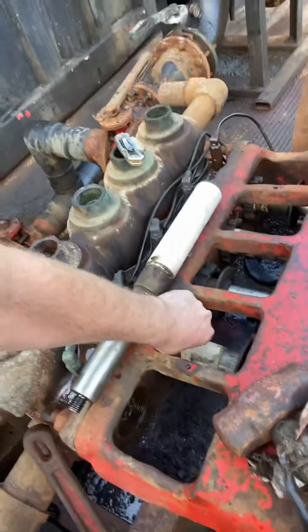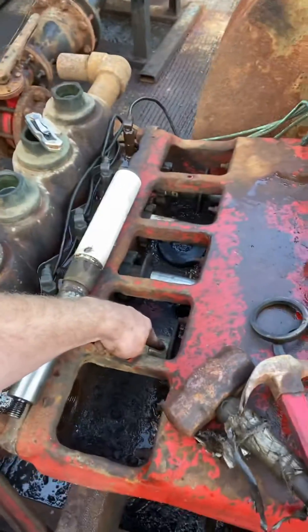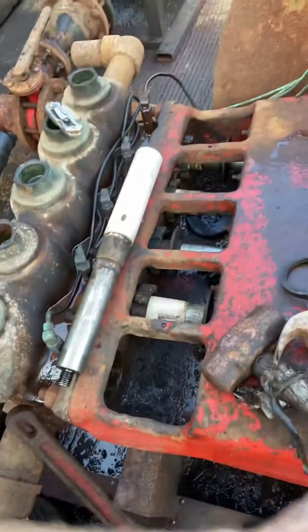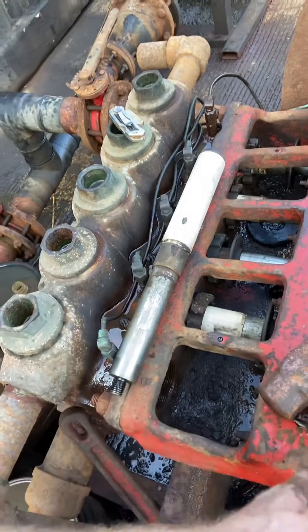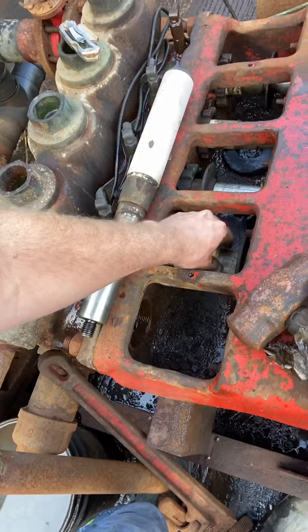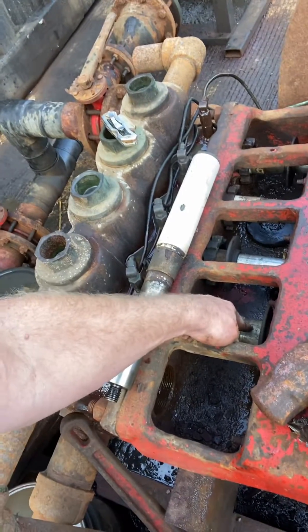Once you've got the packing in, spin your nut back on hand tight. Put your plunger back in. Once the plunger's back in, bring your crosshead all the way forward — you'll feel right inside here, once your fingers hit that crosshead, there's threads there. Bring that crosshead forward first, because if you don't, you could cross-thread it. Once you've got that there, spin your plunger into it by hand, and then tighten it up with your pipe wrench. Once it's snug and nice and tight, you're good.